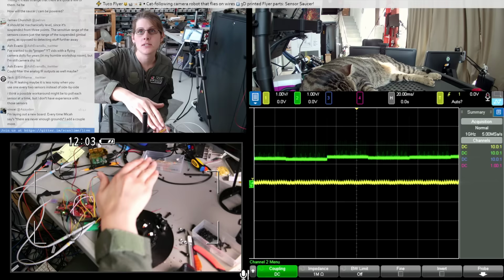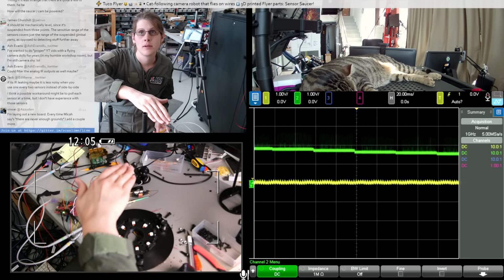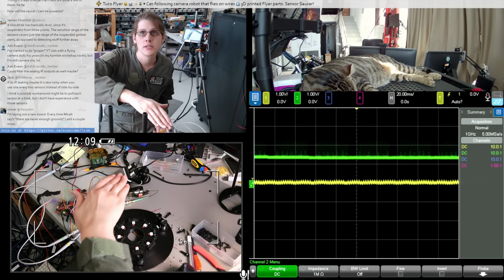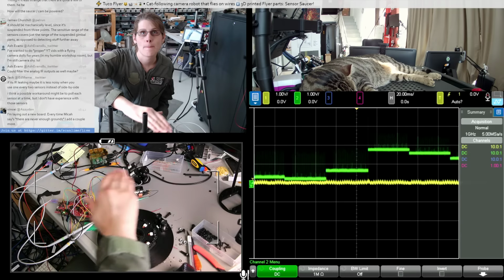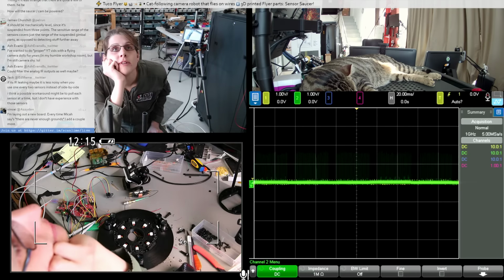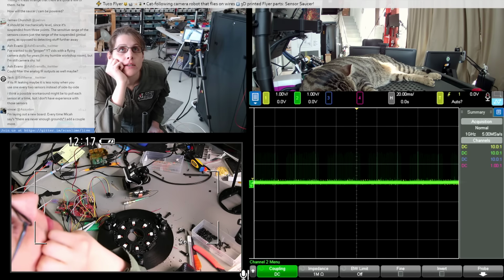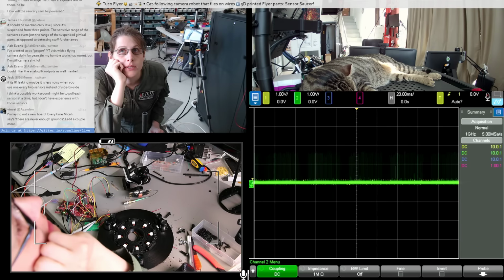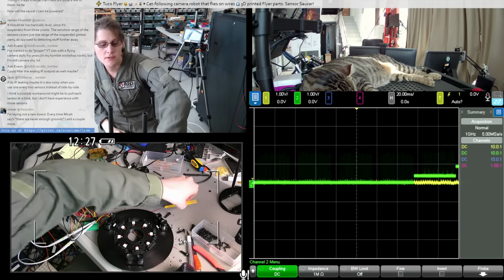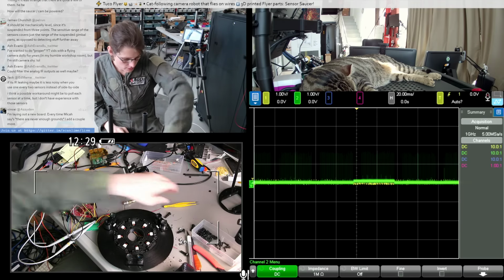It looks like the sensor itself is not updating very fast though, like it's internally only updating every 40 milliseconds. Oh, well, if that's the case, then these are probably too high power to drive directly from I/O pins, so we'll need some kind of other driver. I like that suggestion about driving maybe every other one. Let's see if that causes interference.